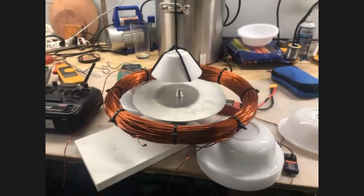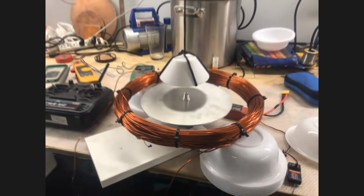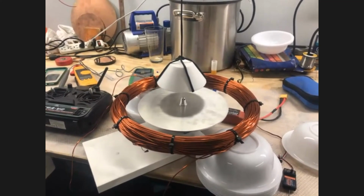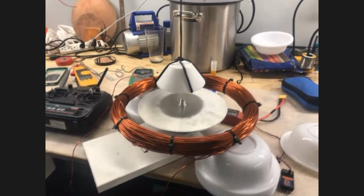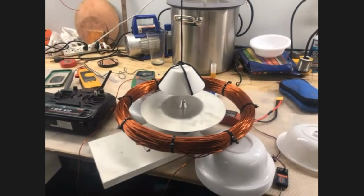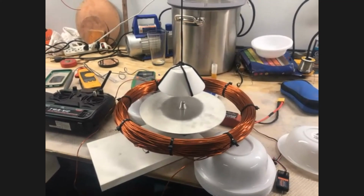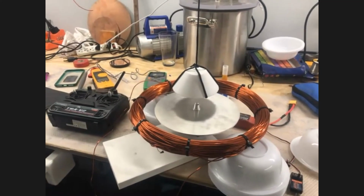The aluminum is grade 5052, which is a mixture of aluminum with a tiny bit of iron in it and also magnesium. And magnesium and aluminum, according to Alzofon, have very similar properties in terms of their dynamic nuclear orientation. So that's not a problem. A little bit of iron is actually desirable because it allows the magnetic field to permeate a little bit better.